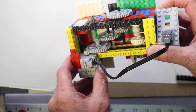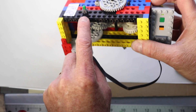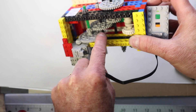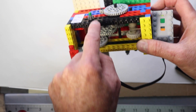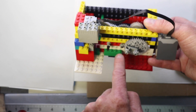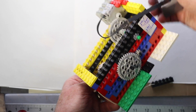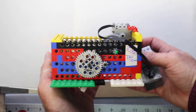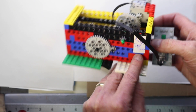Now this is my biggest gear down — it goes from the smallest gear to the largest gear four times. That makes it so that the string will only pull one foot in 15 minutes. So one foot in 15 minutes, or about an inch per minute roughly.